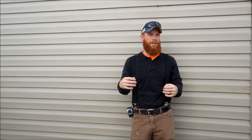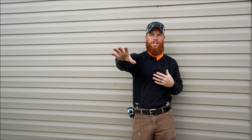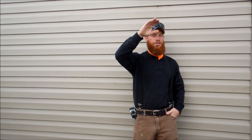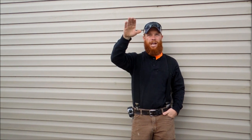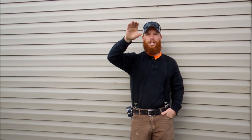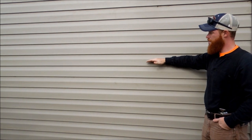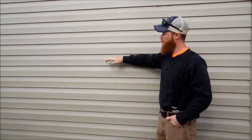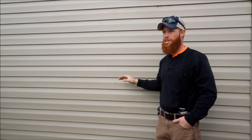We do get some good southern exposure here, but unfortunately the neighbor's house is about 30 feet from where I'm standing. Because of where the sun's travel is during the winter months it's kind of low, and it was casting a shadow about right here this morning. As long as I keep my collector above this area and mounted up high, we should be good to catch as much sun as possible.